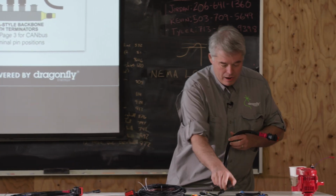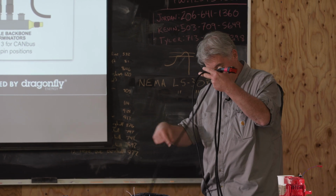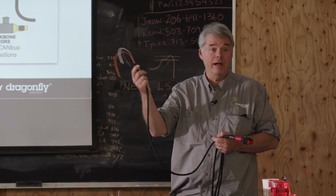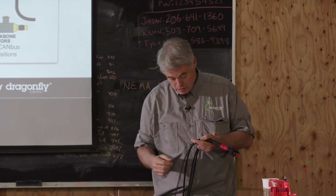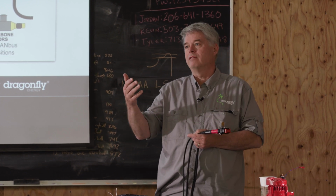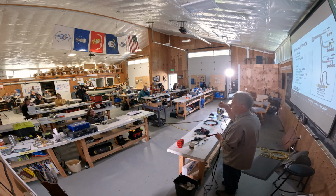What we have in the harnesses, and I'm going to go into more detail on each of these, is one leg that goes up toward the instrument panel. It has your power, your ignition, your idiot light. It has a feature-in wire if you want the regulator to behave in different modes. That feature-in wire can be selected, for example on lead-acid batteries, as a way to select the equalize phase. On a lot of lithium installs, you'll connect your charge allowed or charge not allowed to the feature-in wire, and that's how the BMS can use its charge enable wire to communicate.